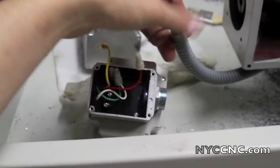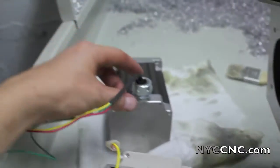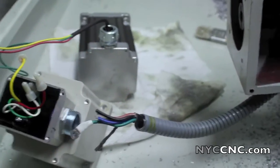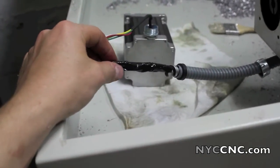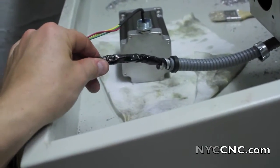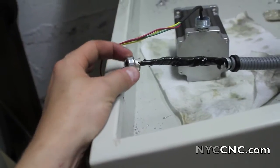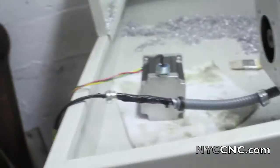The motor is free. I also removed the old conduit cap screw, which I'll replace with the one on the new motor. I've got the old and new wires taped together. If you haven't pulled wires before like this, make sure you use enough tape so that it doesn't slip — that's a pain if it does. Make sure the joint is smooth enough to navigate corners, but not so thick that it doesn't fit through any holes. Also make sure you don't have any kinks in your wire.